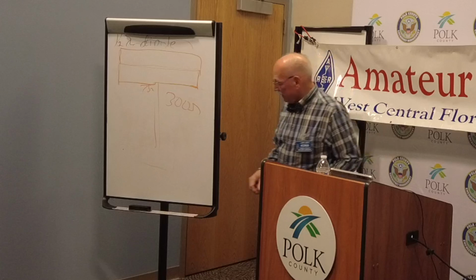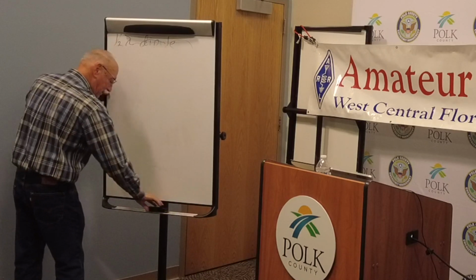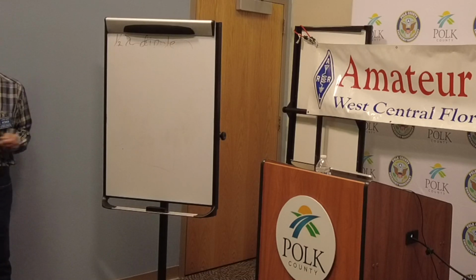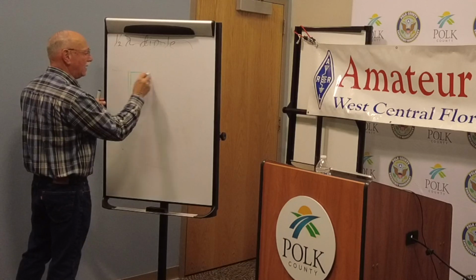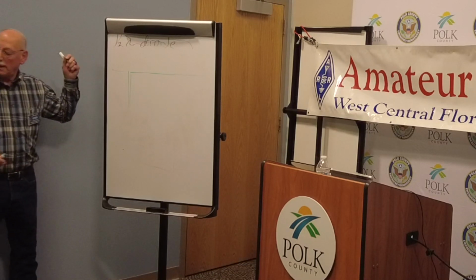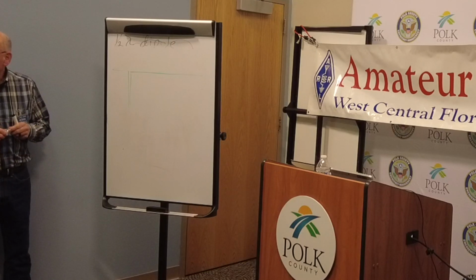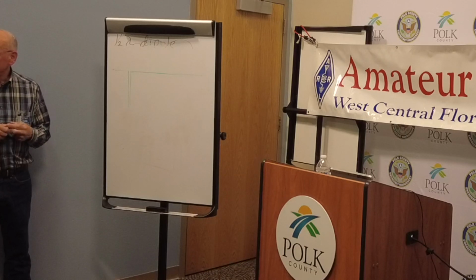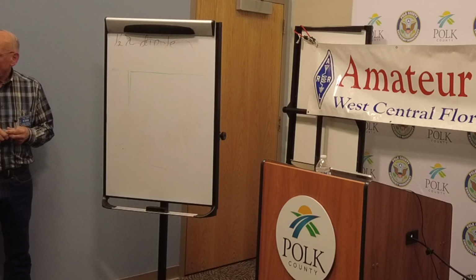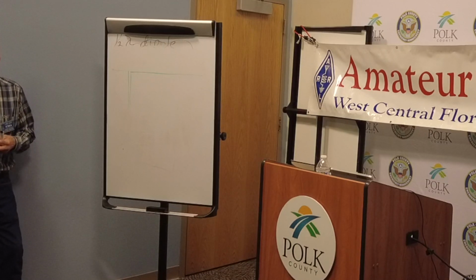Okay, off-center fed dipole. Had the question about that. Roughly, typically we put it at about what? 1/3, 2/3 off-center fed? Yeah, something like that. Mine is not, because I use it from 10 meters to 160, but somewhere 1/3, 2/3. So what do you want to feed this with? Well, if you feed it with coax, you're going to have a severe mismatch. So you usually use a balun. Well, a balun is 1-to-1. You usually use a 4 to 1 or 9 to 1 transformer at the feed point. That brings that high impedance down.